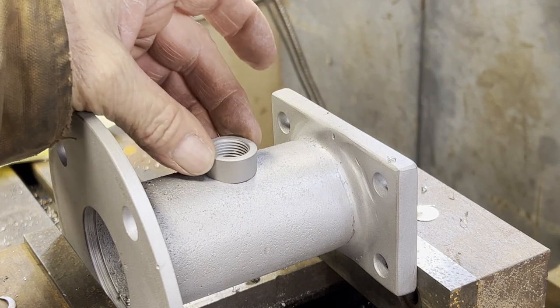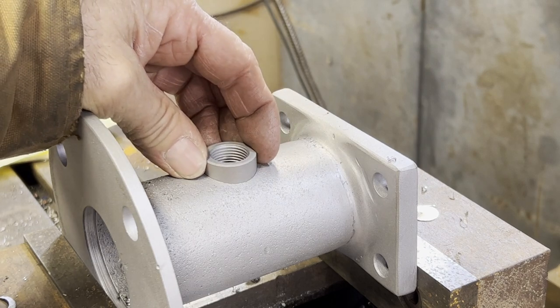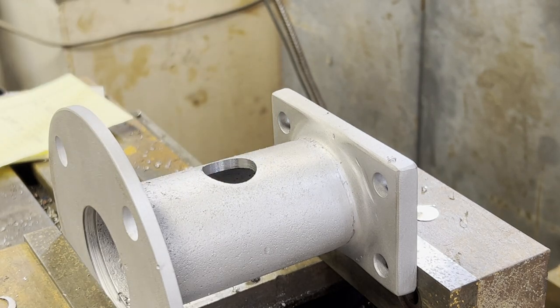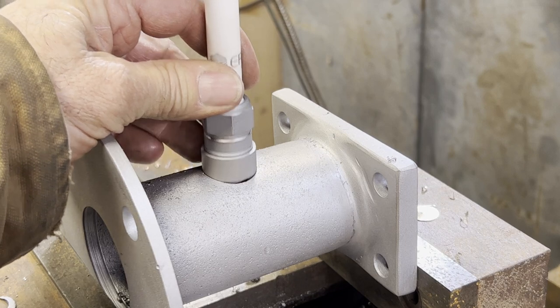I knew the first adapter I needed to get out so it could be put back on. This one I got a little bit more time on. So I got the correct 18 millimeter bushing for the oxygen sensor, and I like to get it welded in where it's in the stream of the exhaust. Here I'm just using an old spark plug to kind of hold it in position while I weld it up.